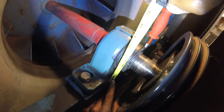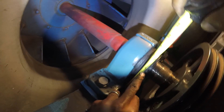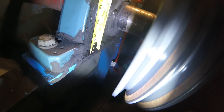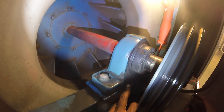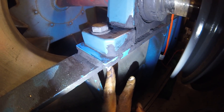The next measurement is from the base to the center of the shaft. I got three and three-eighths inches. So I've got my length, my width, the base to center, and the center-to-center of the bolts.